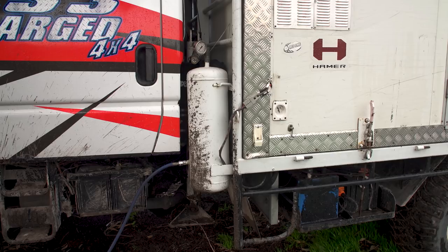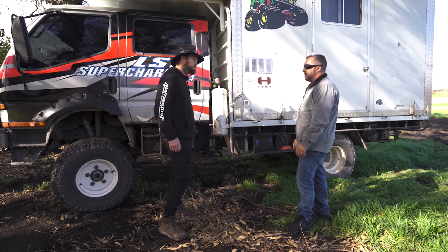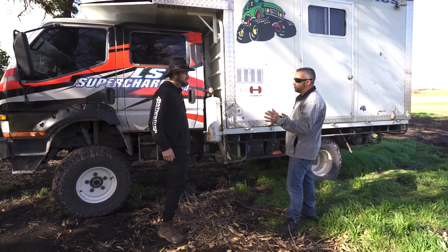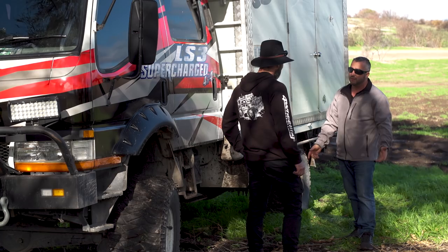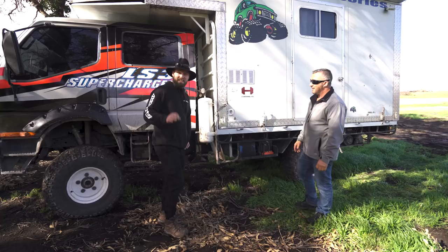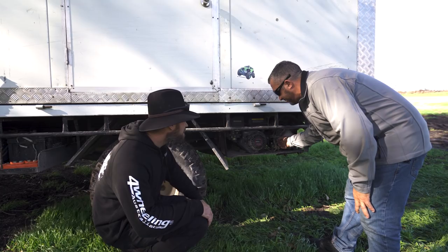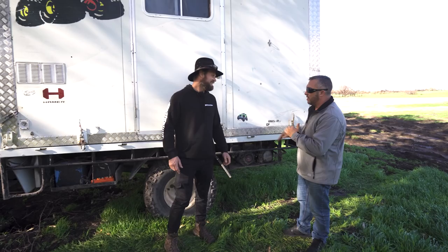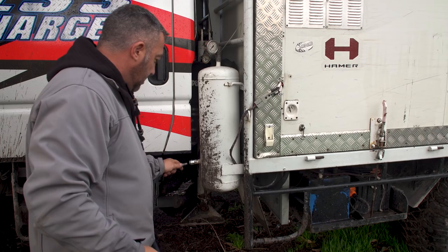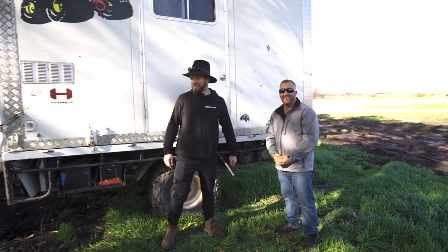So that's hydraulic, and this is air — my air tanks. I've got one on either side with a gauge on it. What do you fill that up with? I've actually got a compressor like your normal home compressor — it's an 18 CFM. I've pulled the actual pump off and put a petrol 6.5 horsepower engine to it. As that starts it pumps it up and I can pump these tyres up in a minute from 15 PSI to 70 — in pretty much a minute. There are no small tyres here either. The compressor is right here — very simple, you've got the pull start as well. I've got 150 PSI at the gun and air tools and so forth underneath the seat.